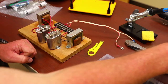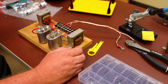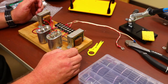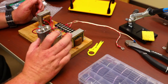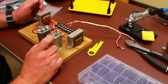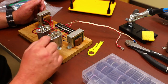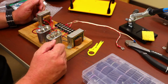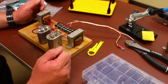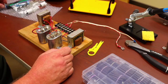You don't want that. So when you get a new pair of speakers off of eBay or Craigslist or whatever, any type of the old Klipsch speakers, go in there and look and see if they have this type of caps. If you see any grease around them, this one's got grease around the top of it. It looks like somebody spilled vegetable oil or something like that. Look at the top of it. This one's leaking. This one's dry. Pretty common for a 40-year-old set of caps.